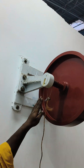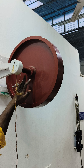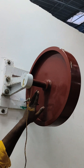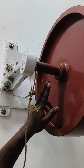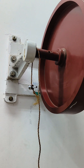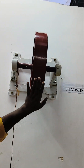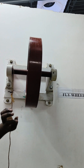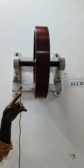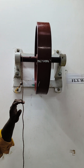This is the side view of the flywheel — here we can see the axle and the flywheel itself. When we mount the rope on this axle, we get a lateral displacement due to the tension applied by the load. This is the front view of the flywheel setup: the flywheel, its frame, and the rope on which we apply the load. Now we can see the flywheel is about to stop — this marks the time T2.